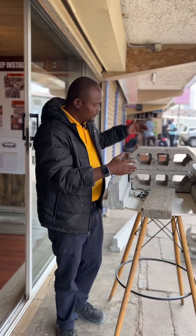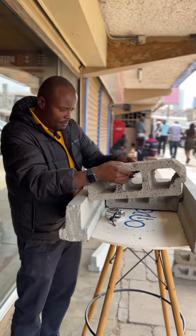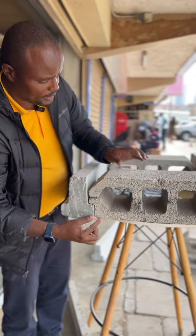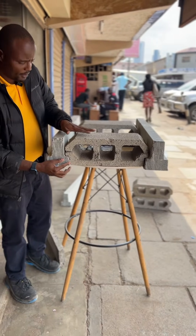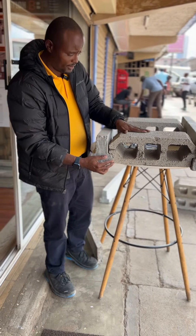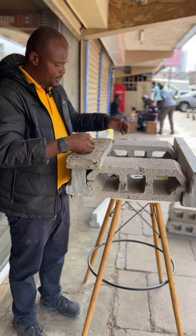Then, the concrete topping. You can see the way the pre-stress T-beam locks in tandem — you can see the way it fits precisely. This tells you the concrete topping will be very minimal, at most 50 millimeters. It can go higher, up to 65 millimeters in case you have big pipes, because the services go on the surface. While with the pre-stress flat beam, the block will leave a lot of space.